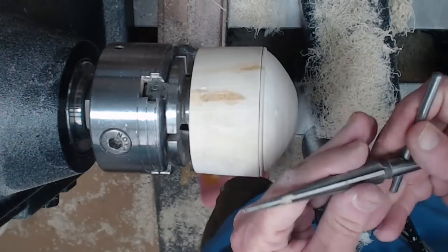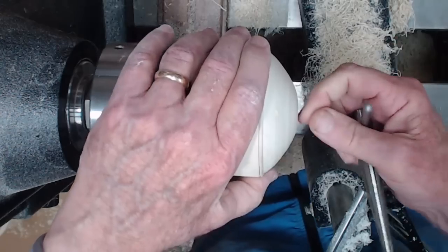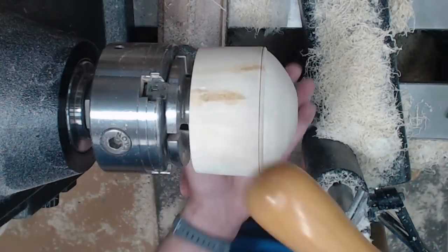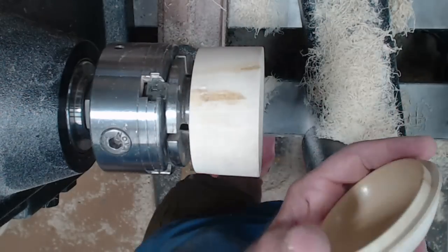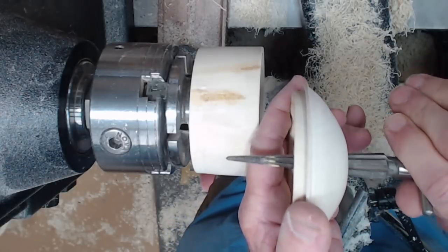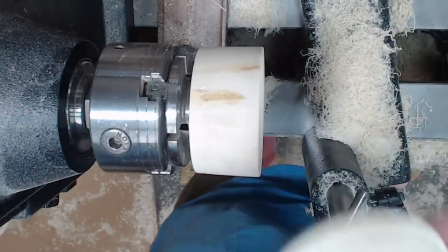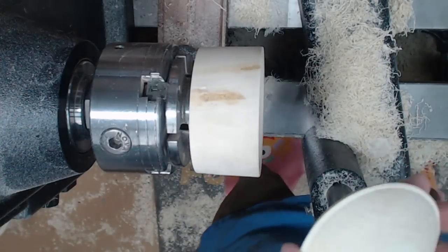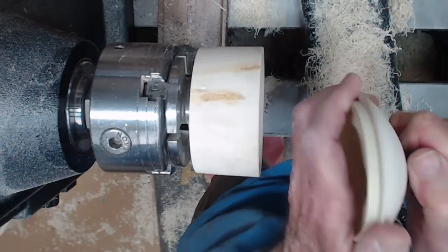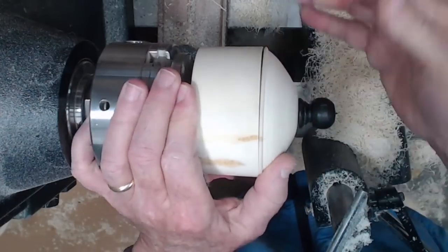And that's this plumber reamer. I find this great for when I'm trying to refine a hole where I've got a tenon a little too large. Unfortunately, I gotta take this off to use it, but that's okay. We found out how easy that was by just popping it. So I'm gonna come in here with this and just twist it a couple of times and let those flutes do the work just a little bit. Yeah, that's a nice fit. Nice snug fit.